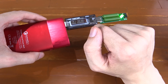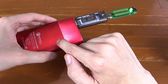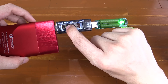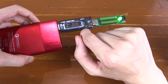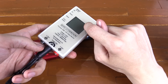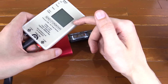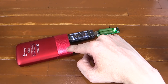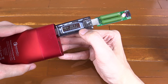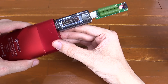One thing to keep in mind when doing your calculations: the rating on the power bank is at 3.7 volts, which is the internal battery voltage, but when you're drawing power out you're drawing at a much higher voltage, so there is some math involved to correlate the numbers. That's why I prefer my Portapower watt meter, because it measures watt hours rather than just milliamp hours — a more accurate figure — but if you're willing to do the math, this tester will do the job just fine.